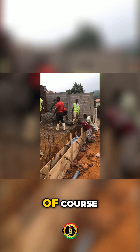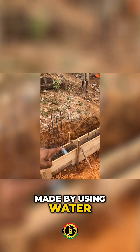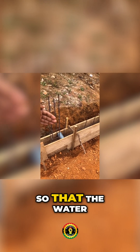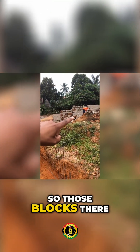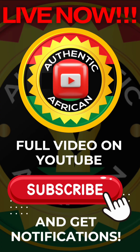The wall is built here and then the wall on top of it. Even though it's cement, and cement is made using water, you have to have these little weeping holes. They're putting these little tubes in so the water will come through and not erode the bricks or blocks — with too much water, those blocks can become eroded, so that's why you have these weep holes.